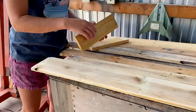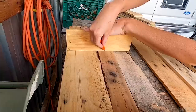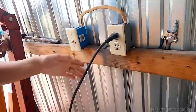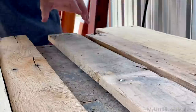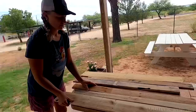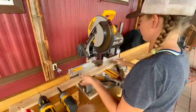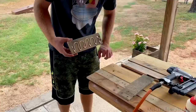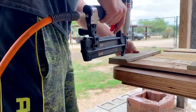I'm building some more pallet board picture frame shelves. I'm going to have two on either side of a bigger family picture, so these ones will have two shelves. I'll want the top shelf around right there. These two are already sanded because I stole them from our van pile, but I'll quick sand these ones so they're ready. The backing pieces go right over the top, we'll glue and nail the backing plates in, then screw the shelves in from the back — be really strong that way. Sounds brilliant.